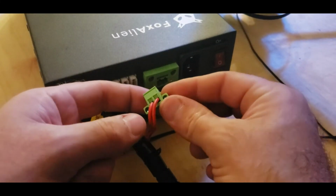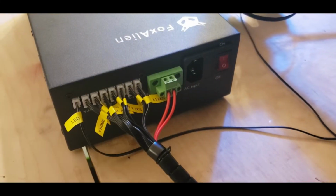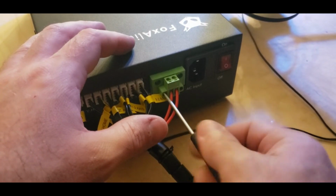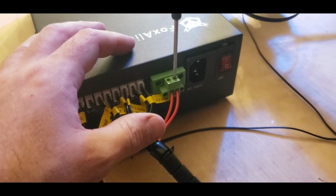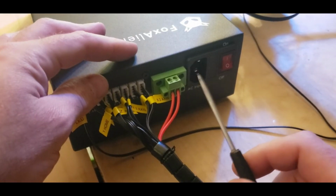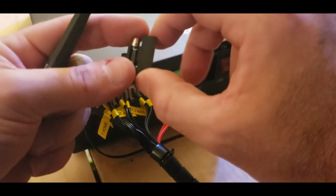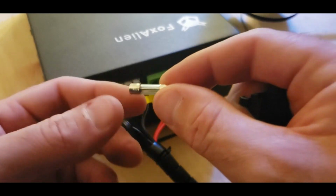So it has a few extra flathead screws to attach in. And those are optional, but I of course will be attaching them in there just to make sure this is quite secure. And since we're here as well, let's go ahead and make sure that these are snug. So if you do have any issues with this power supply, there's actually a fuse right here built in. So we can pop this out just by sliding that out right there. We can take a look at that fuse. This is a 10 amp, 250 volt bus fuse.